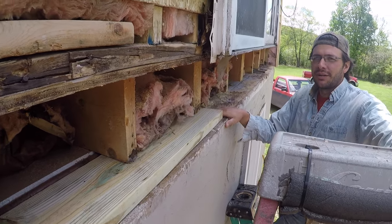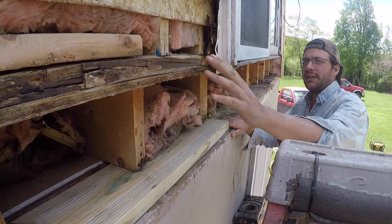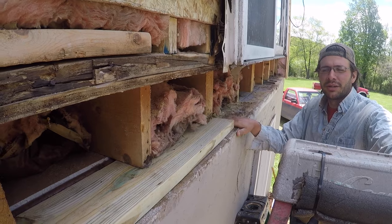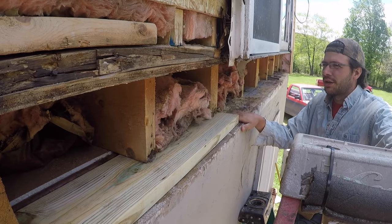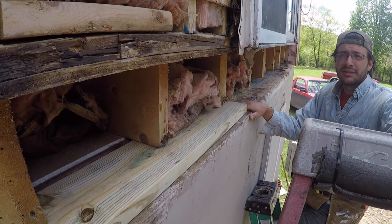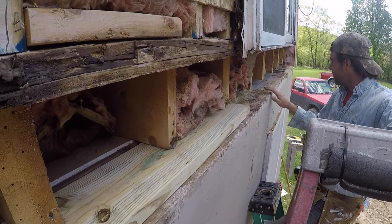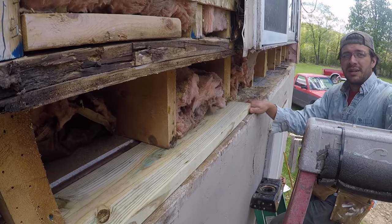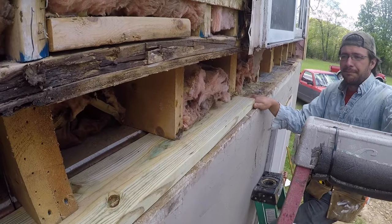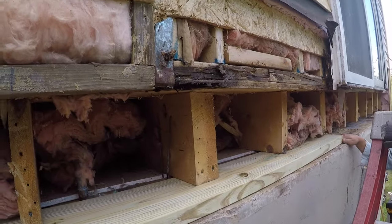This was done about 30 years ago and they just cut the vinyl off and nailed right to it with their ledger board — that was all the flashing it took. About 30 years before it really started to pull off. The flashing is code now anyway — it definitely is code. Some decks have fallen off that were two stories up and killed people, because the wood rotted, the deck pulled away, fell down, and people got hurt. So you've got to make sure it's done right.